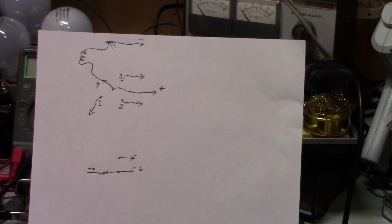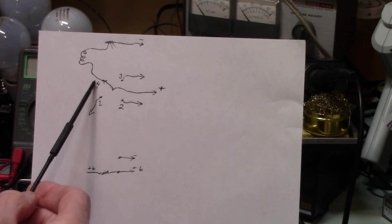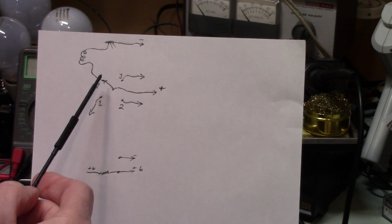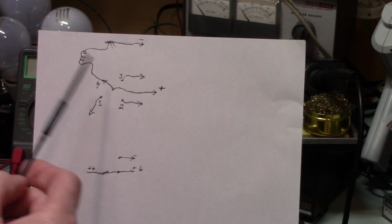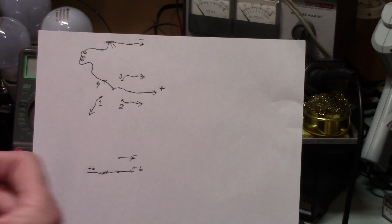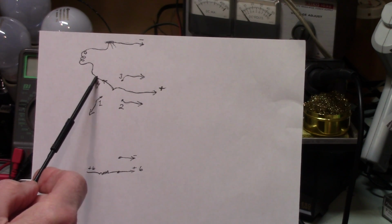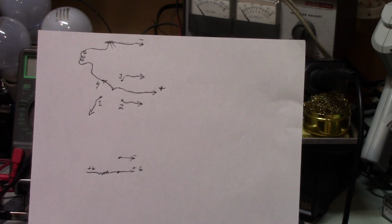Playing around with a bulb and a variable resistor, I discovered that by the time the light dimmed to the point where it's not visible, you're winding up with about 100 ohms here. And in my case I was using 8 volts, but you'd wind up with around 3 volts or 2 volts on this line, not 6. So I got faked out.